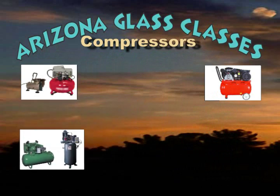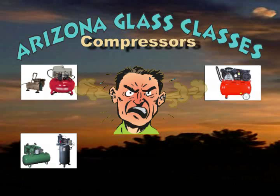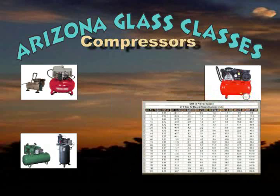You can never have too much air, but running out of air is aggravating and distracting. The fact that the compressor runs continuously causes the air to draw more moisture, resulting in moisture problems and clogs at the pressure pot and nozzle. The forums at Arizona Glass Classes website has reference charts to help you determine how many cubic feet per minute you will require to carve at a specific air pressure and nozzle size. This will help determine your compressor specifications, not the size of the storage tank.